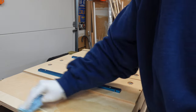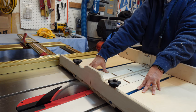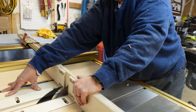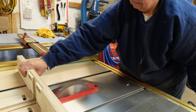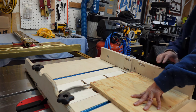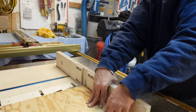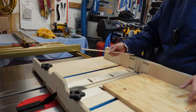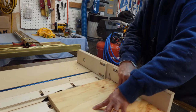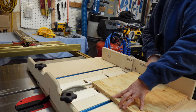I'm going to put another coat of wax all over the bottom of the table saw sled, and I'm going to make another first cut — which I guess would technically be my second first cut. Now I have a square piece of plywood cut and I'm going to do the five-cut method. I'm not going to go into a lot of detail about how to do the five-cut method — James already explains it very well in his video and there are a lot of other videos on YouTube explaining how to do it. I should have moved those zero clearance inserts over — I forgot — and I've got my little cutoff pieces falling into the track. So when you do this, remember to move those zero clearance inserts over.